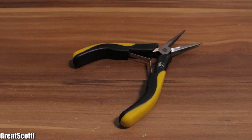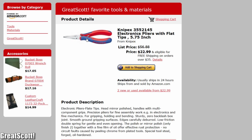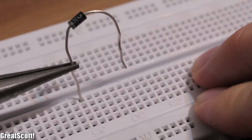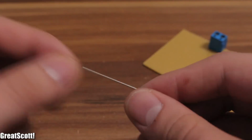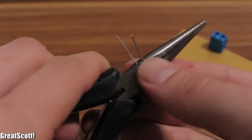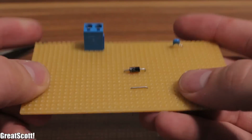Needle nose pliers are also essential. Mine is from Toolcraft, but the next one will be from Knipex. It is like a heat resistant extension of two fingers to insert parts, bend pins or hold wires while soldering. And here's a cool little trick. Place your bridge wire all the way at the base and bend it. Like this it will always jump across two holes of your PCB.